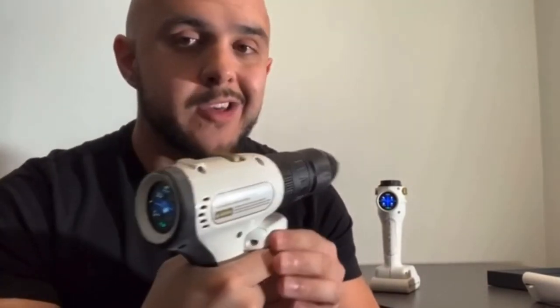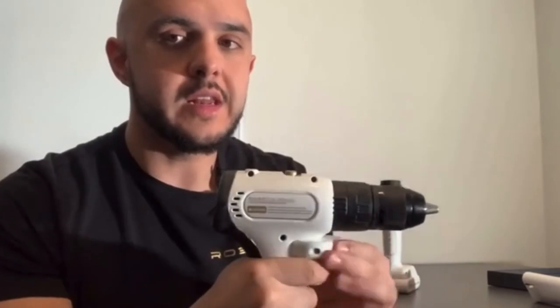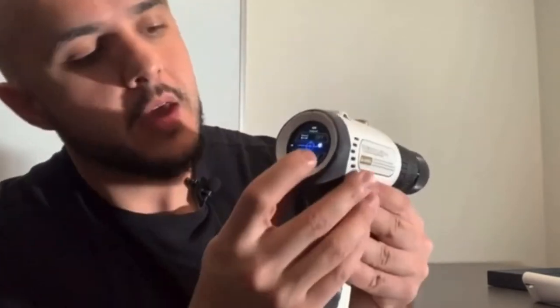The tool actually has lasers like we mentioned. There's one laser right here and one laser at the bottom. The laser at the top actually swivels around 180 degrees. What that allows you to do is position it so you can hit side walls and position something 10 or 20 inches apart — you're going to know right away on the screen. You go in there, click it, and you'll see a value. You can actually see the laser behind me — it gives you a real-time reading of whatever you're pointing it at. You can swivel it around 180 degrees, hit that side wall, and position something 5, 10, or 20 inches apart. You also have metrics so you can change that right on the fly.